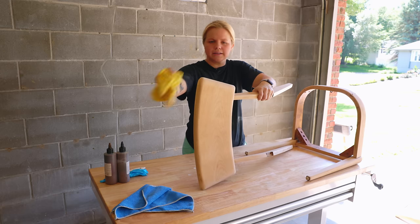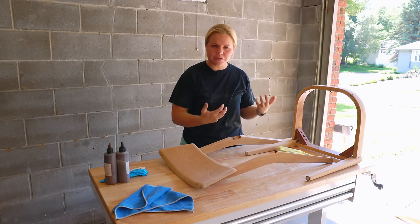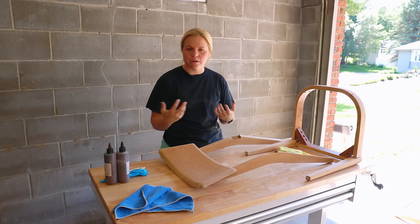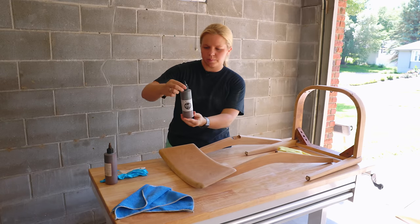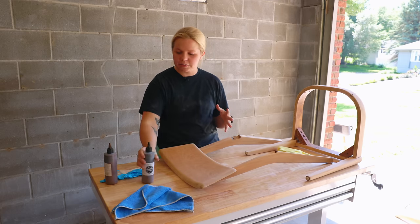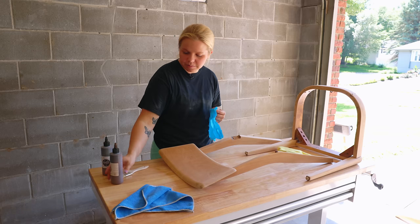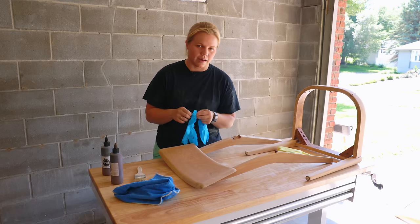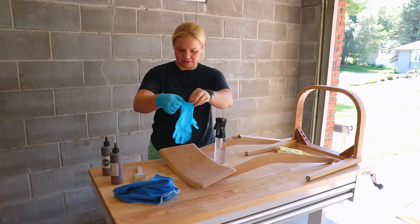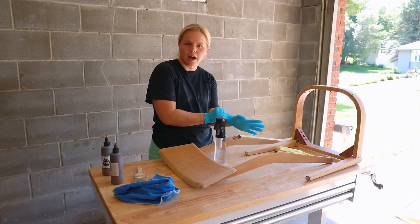Everything is nice and wiped back. I am going to be using the same stain that I used on my dining table because I really want them to be cohesive even though they're from two different sets — we can join them together by using similar or the same color. I am going to be using Lily Moon Paints Gel Stain, a smoky gel stain in the color Tennessee Whiskey. It's water-based so it's super easy to apply. I like to wear gloves and I'll apply it with a chip brush and wipe it back with a microfiber cloth. I can't forget my mister bottle because that's definitely important when you are using the water-based gel stain — it really helps you drag the material across the surfaces without it drying up too quickly.